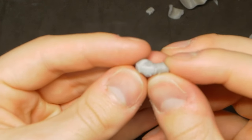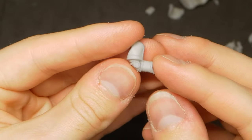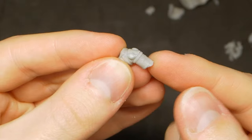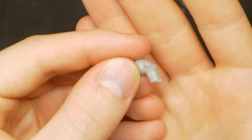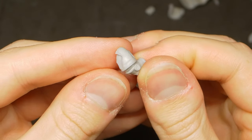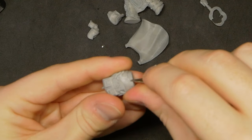And due to the thin nozzle, and therefore weaker interface on the top of supports, a Z-top distance of about two layers, or 0.16mm in this case, was really nice and close to avoid blobs on supported areas, but still really easy to remove.